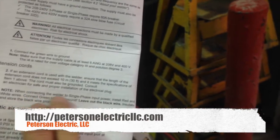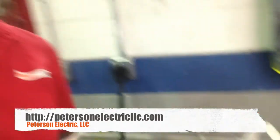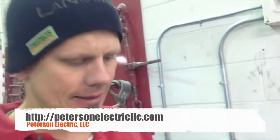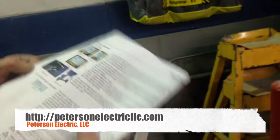It says: note, when wiring single phase, leave off your black. You don't want to mess that up, because normally we're used to taking our white out and using our black and red. But on the three phase, it didn't even specify if it was black, red, and blue — which is not good.